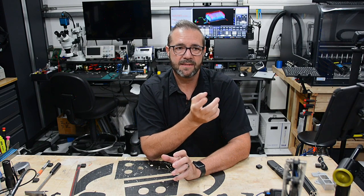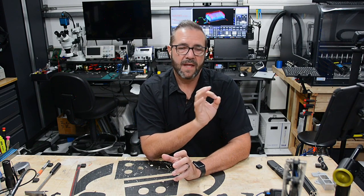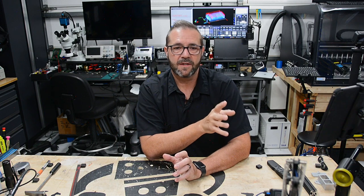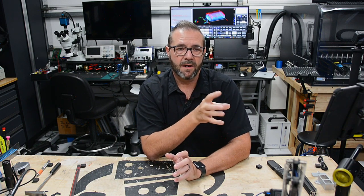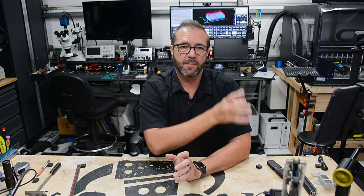If you ever need I/O or additional capabilities, I'm not sure if they have some reserved pins that they could use for that functionality, possibly. But you're going to have to wait for them to iterate on that hardware and release a new version for you to upgrade and get that capability on your machine. Aside from that, it's running the GRBL, or Gerbil, if you will, CNC controller implementation, which is limited in its support for G codes and M codes and functionality.